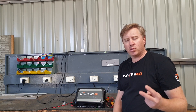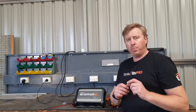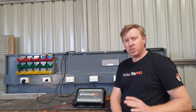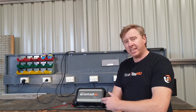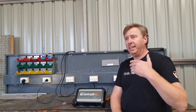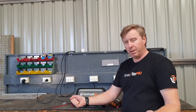With the BP35SR and HA, it does have two solar inputs. What some people have been doing is putting one solar string up to the roof on top of the caravan with panels up there. Then secondly, they'll run either through an Anderson connector or similar down to a portable set of panels, which people can move around outside to catch the rays — because you might have parked the caravan underneath a tree and want to move those portable panels around.